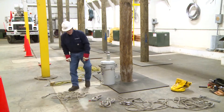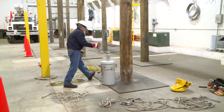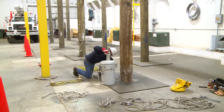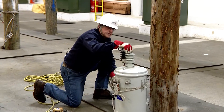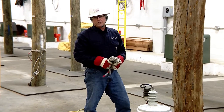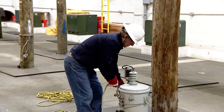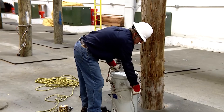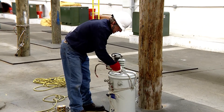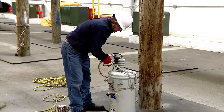While I'm tying these knots, I'm going to check how much the transformer weighs — it's important to know what you're lifting. It has a material nameplate, and all that information is on the material nameplate. This transformer weighs 194 pounds. The rope blocks are good for 1,400 pounds, so you can see we have a lot of safety factor there. This rope would be rigged on top of the transformer, and this rope would be where you connect the rope blocks to pull it up and place it on the pole.